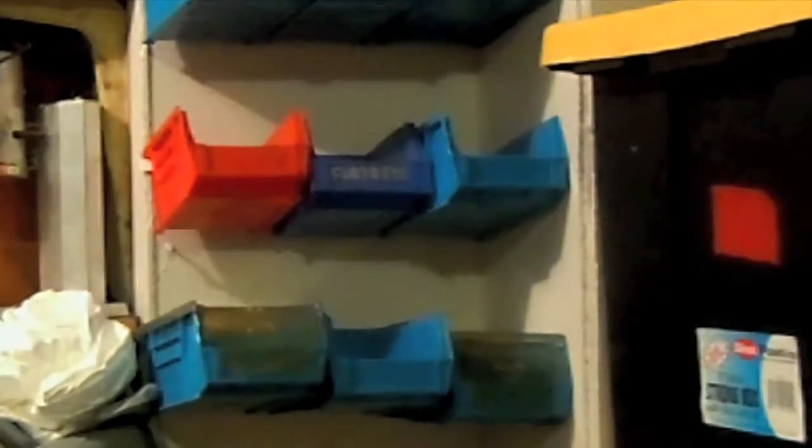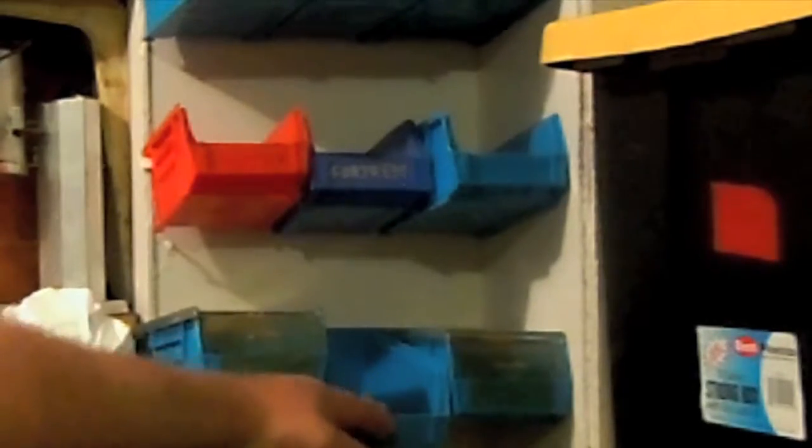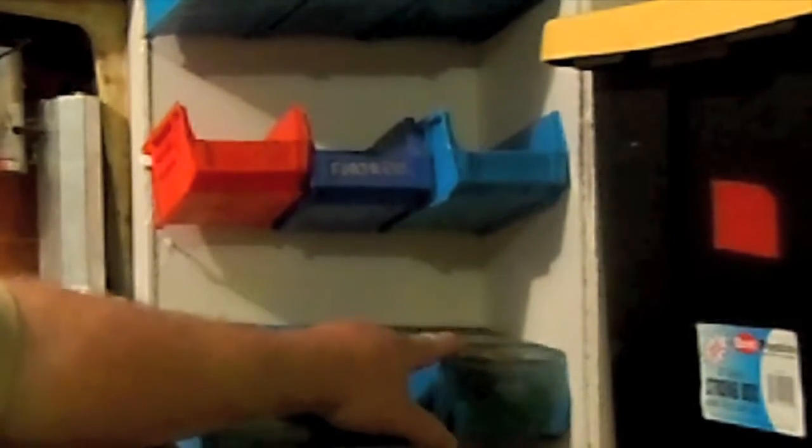What I did find was an eight-foot section of this plastic molding. It's not as strong as the aluminum flashing, but it was cheaper and it was easier for me to cut. I just took a pair of aircraft snips and cut them into about one-foot sections, took a pneumatic stapler and just stapled them to the wall. I didn't worry too much about making it exact dimensions because as you put the bins on here, they're kind of gonna bend and self-level a little bit anyway.